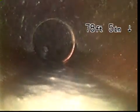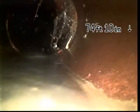There's something that flushed through there. It's like a candy wrapper or something. That'll wash through. We've already pushed it about 20 feet. Every 3 to 5 feet is a joint. Here we have roots right here. Because we're in clay, you said? We're in clay. See the roots right there? Yeah. See, they're real thick through there.